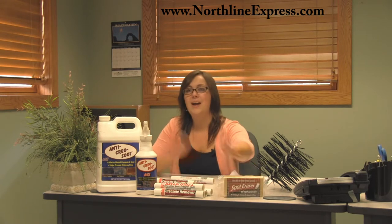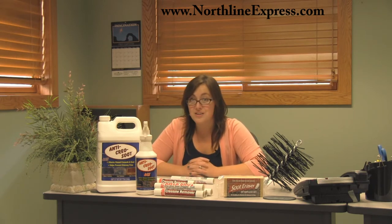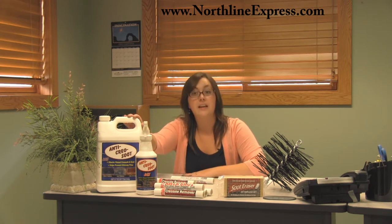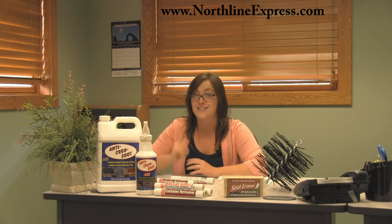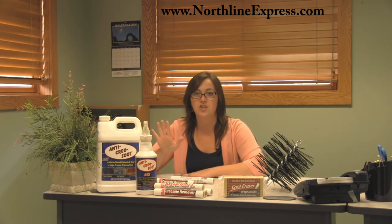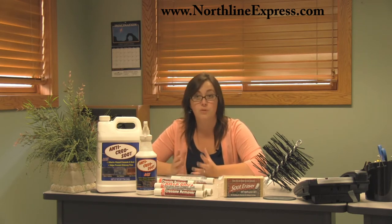Next, let's talk about ACS Creosote Remover. If you use ACS Creosote Remover prior to sweeping your chimney, you'll be amazed at how much easier your chimney is to clean. It's been the leading creosote remover product since 1982 and is a unique non-flammable manganese-based liquid catalyst. It's professional strength but consumer safe, and it attacks and disperses dangerous glazed creosote and soot. To use, simply spray the interior surface of your fire chamber on the wood, either under a low burning fire or before you light your fire.